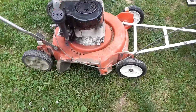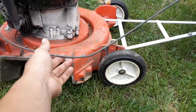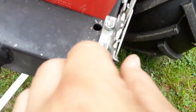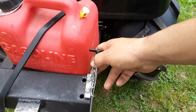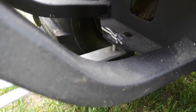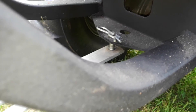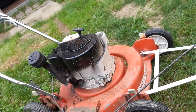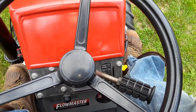Okay, so this is it hooked up. The cable is steel braided so it won't actually get stuck in anything for the range of motion — it runs up to my rear hitch where I have two bolts hand tight. You can control it to full throttle, and all the way back is stopped, so if something happens I can stop the engine. There's enough flex in it because it's thin aluminum that it will handle some pretty decent hills. I'll fire them up and show you guys how it pulls and cuts — second gear.